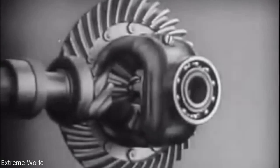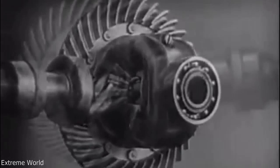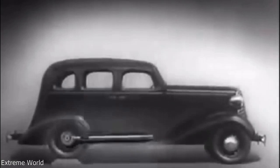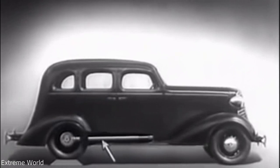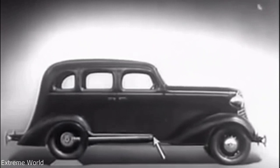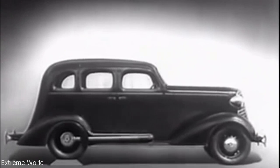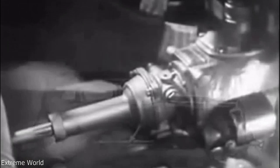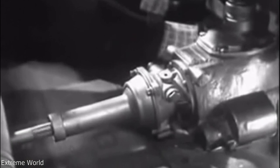Notice that the power is connected to the differential at the center line. We can make our model more compact by moving the gears closer together. When we put our differential in an automobile, we have to leave room for the drive shaft, which carries the power from the engine. We may build the floor of the car above the drive shaft, but if we do, we won't have much room inside unless we make the top of the car high too. Of course, we could lower the floor and ceiling, but the drive shaft would be higher than the floor. A shaft in the middle of the floor of an automobile would be inconvenient for passengers and awkward for carrying luggage.